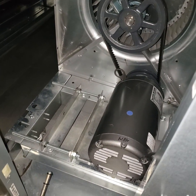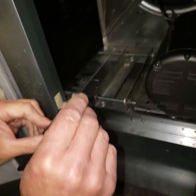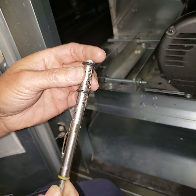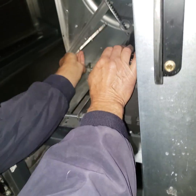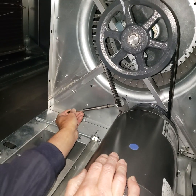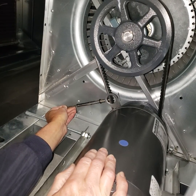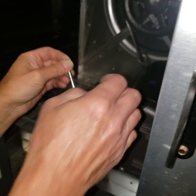So the spec is 4.6 pounds and 0.1 inch. This is set at 0.1 here, and that should be the approximate deflection distance we have. The pounds we read here. I'm lining up here and my reference mark is here — first I line up the belt with the reference mark, then I'm going to push there. The reference mark stays and the belt moves. Then I line up my O-ring with the reference mark.